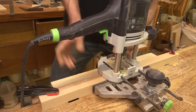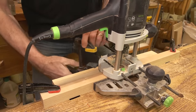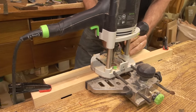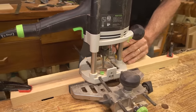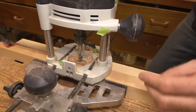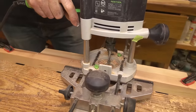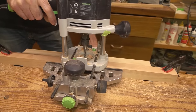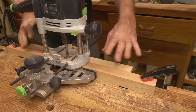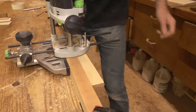With my fence firmly against the work piece, I'll bring this up and stick it to the base. Sometimes I'll take a little quick clamp like this to snug the tape down — make sure it's fully sealed. When that stuff is down, it's awesome. What's cool about this now is it feels way more stable. I'm not sliding around at all. I've gained stability — I don't feel like it's rocking anymore. I've created a really nice custom guide for plunge routing into a work piece.